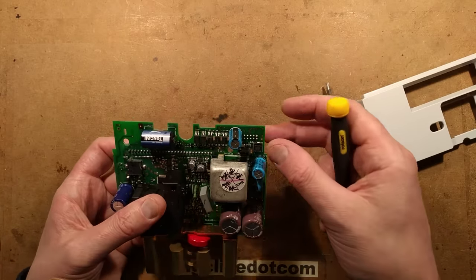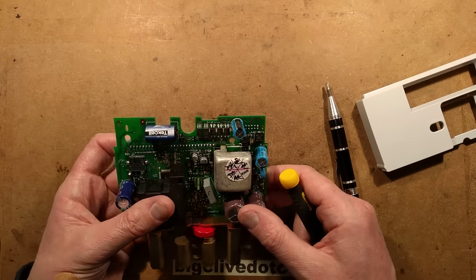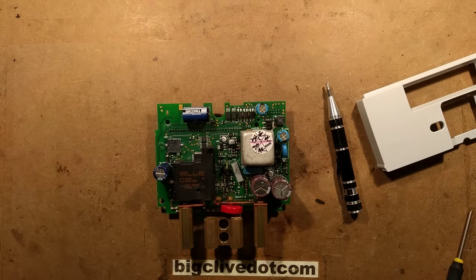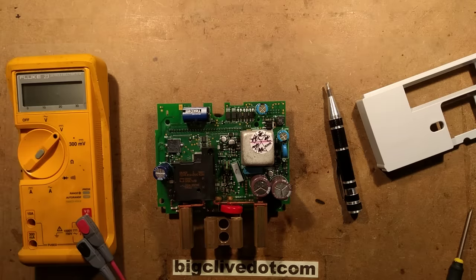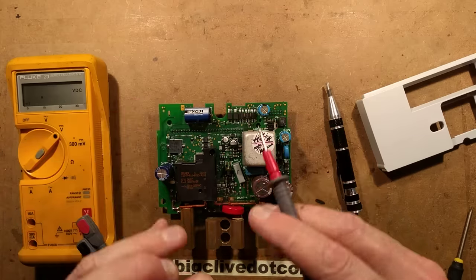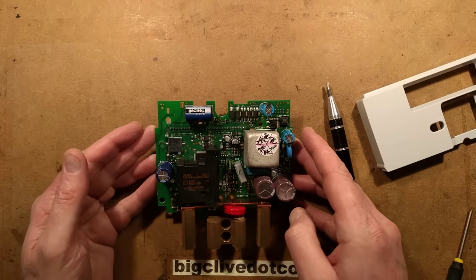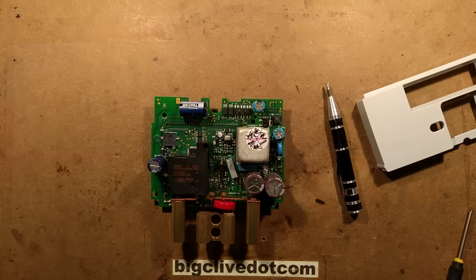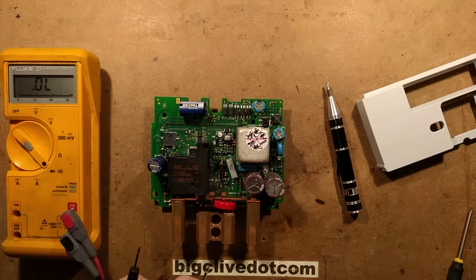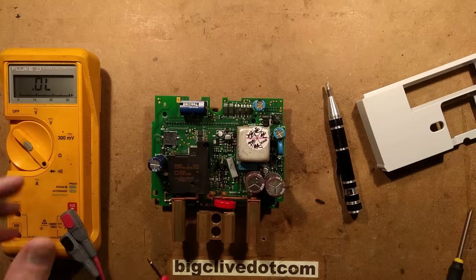The isolation could be for safety, with a low-voltage supply going to the port and just switch signals. There's a little lithium primary cell - these have a lot of lithium because they're designed for super long life and high capacity and are non-rechargeable. Testing it with a multimeter: 3.65 volts, fully up to spec. Testing the relay on diode mode - it appears to be normally closed, only powered when they want to disconnect you, which takes the load off it. That makes sense.